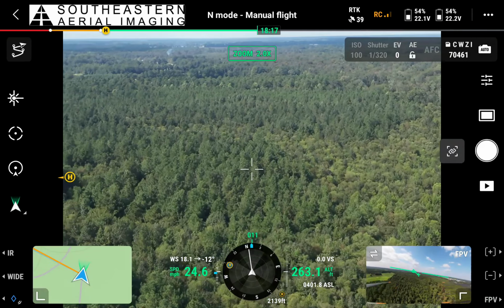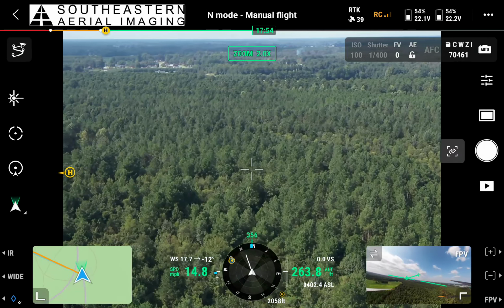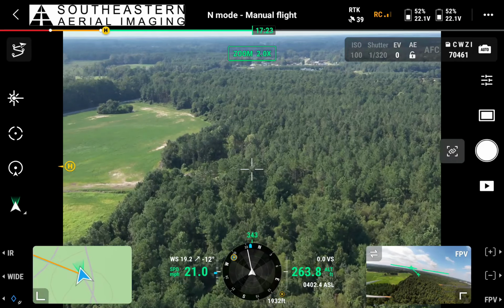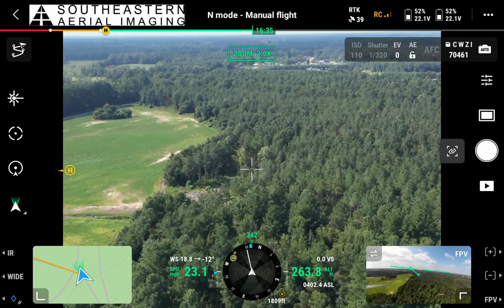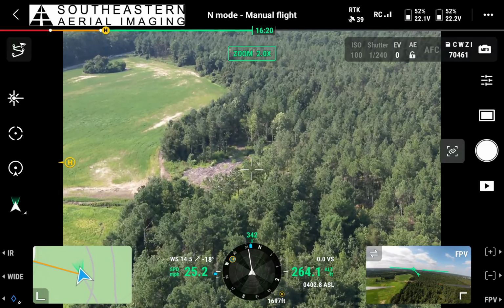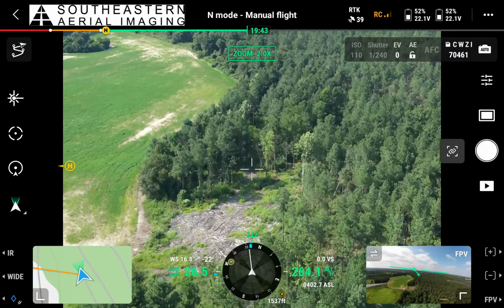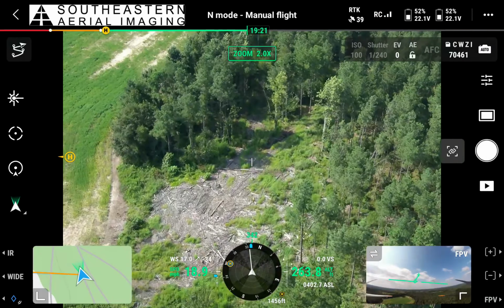All right. Another thing you're going to notice with this particular drone is that it allows the use of RTK positioning, and this is vital. As both a hydrographic surveyor and aerial surveyor, I do not fly without some form of RTK, or position correction systems. What that does is increase the accuracy and precision of the drone itself, and the products will be georeferenced with a much greater degree of accuracy and precision compared to just flying in normal mode.